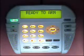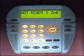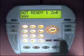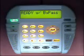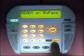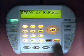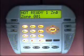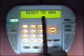If we have a violated zone — in this case we will violate zone 1 — we can do a master bypass of all violated zones by pressing the pound or bypass key and 999, then bypass again. It will bypass all violated zones that can be bypassed by the zone definition. The bypass button will be illuminated indicating that some zone is bypassed. The master un-bypass all zones is bypass 0, 0, 0, bypass, and now all bypassed zones will be un-bypassed.